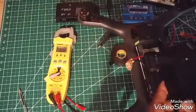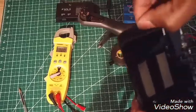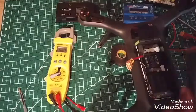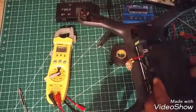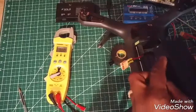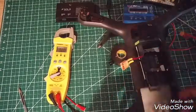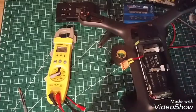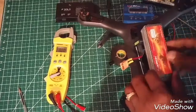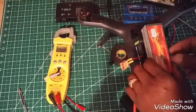When this piece gets put back together it's going to lock because there's a little lip right here. I'm thinking of putting a couple spots of super glue just to keep it together but not so much that I can't open it again. I flew it earlier today and the GPS only got about seven satellites — I usually get 20 or 21 — and what was happening is that having the battery positioned like that was probably causing magnetic interference with the compass. So I didn't fly it very far, just kind of in a circle, and it worked great.